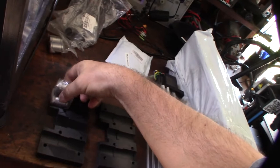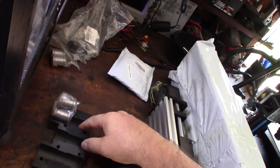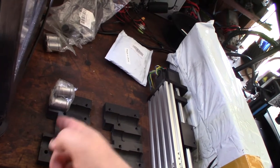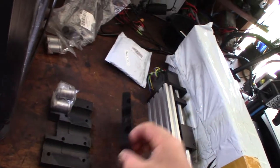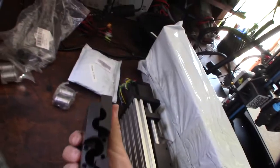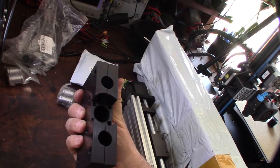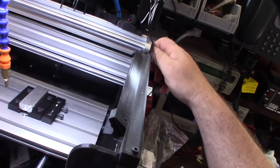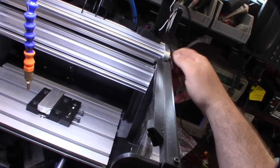And I designed these little plates in Fusion 360. These are actually going to be the plates that mount here and mount this thing at the bearings, so that's going to be the mount for the assembly. I created this to fit in here, and then the ball screw ball nut will actually be right here. It's designed to go together as a piece like this, and it's going to lock down the bearings. That's actually where the ball screw is going to mount. Hopefully it works, we'll see.